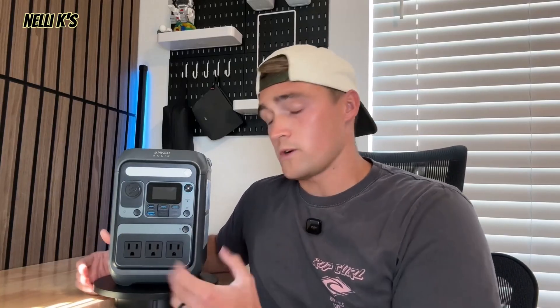This power station is a 288-watt portable power station, so it's kind of similar to the EcoFlow River 2 or River 3, kind of in the 250-watt range. This one is 288 watts, so it's a little bit bigger. It is an LFP battery — lithium-iron phosphate — which is what all the big brands are using now because they're some of the most efficient and safe batteries out there. With that type of battery chemistry, you're getting up to 3,000-plus battery life cycles to degrade down to 80%, so if you use this every single day, it should last a decade at least.